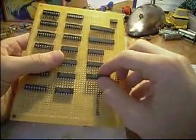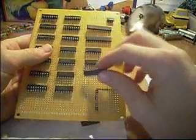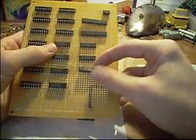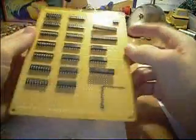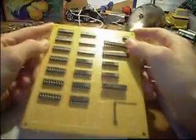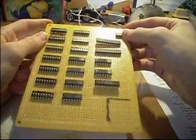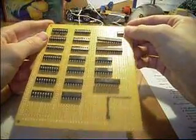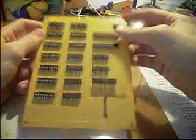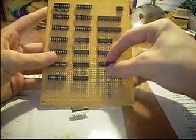What I did is add in this latch chip, which essentially acts as just another storage location and will prevent any race condition situations. From what I've gathered, all the instructions will be one clock cycle instructions, so this will be fairly efficient. I'm not sure how much computing power it will have — I can guarantee it's going to be less than the Intel 4004, and that's saying something — but it'll be quite interesting when I get it finished. If you have any questions or comments, just post them down below and I shall see you later!